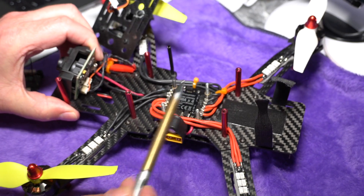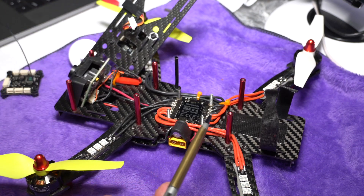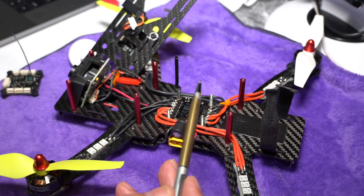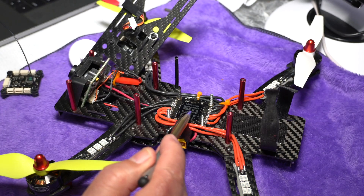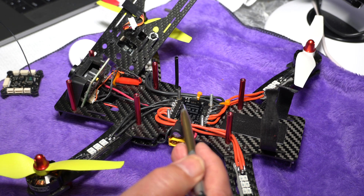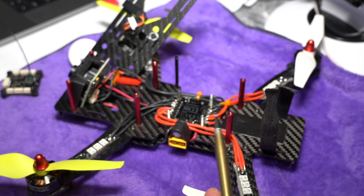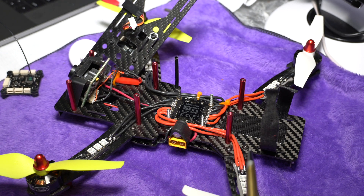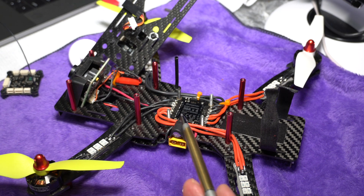The motor connectors are nicely spaced and large enough to use 16-gauge wire, specifically on the 30-amp version, so you can run up to 30 amps to your motors. The ESCs have BLHeli firmware — the freeware version — and support PWM, Oneshot, Multishot, and Dshot (digital shot), allowing much finer and quicker motor response. That quick response is achieved by the high-speed controller and high-end FETs built into the board.